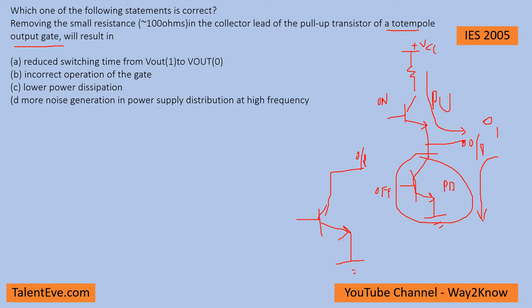So now, the main difference between the open collector and the totem pole configuration is that the totem pole configuration is the fastest compared to the open collector. In a totem pole configuration there are two transistors, and the output switching speed depends on the switching of these two transistors. If we need a one, this transistor needs to be on and the other off — both need to go to saturation or cutoff — and if we need a zero, the opposite occurs, so the transistors must be driven from saturation to cutoff state or cutoff to saturation.